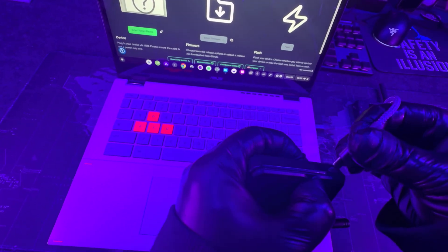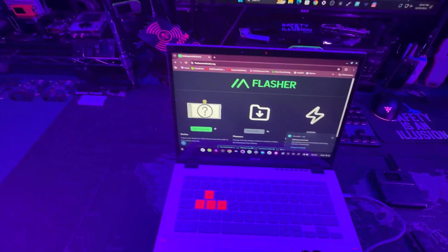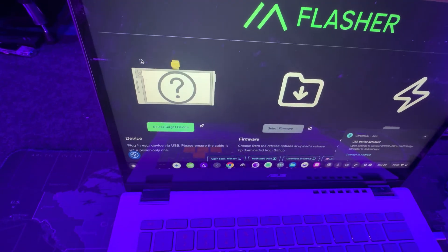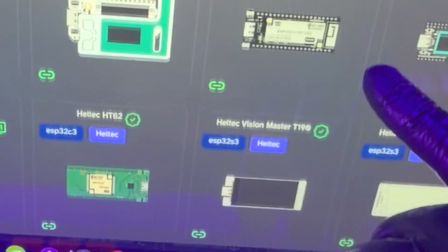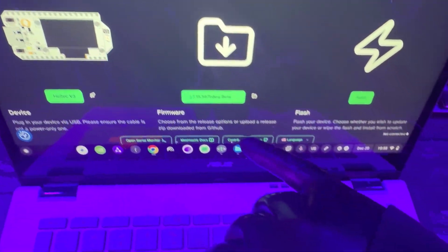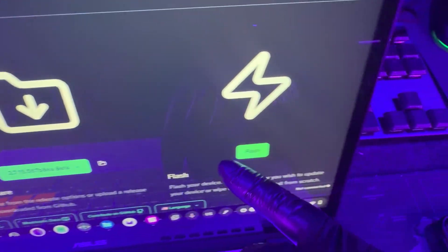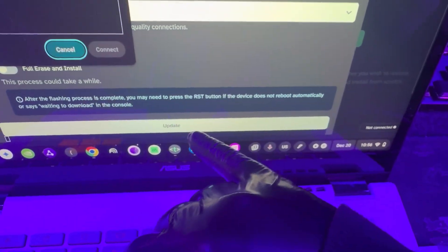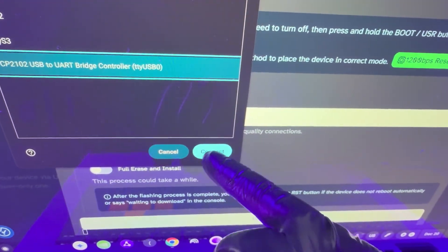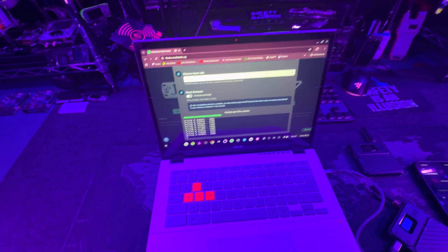You need to plug in your device to get it ready to receive firmware. Back in the day, you used to have to hold down the boot button on the device and then plug it in to get it into bootloader mode. But with the new Heltec V3s, you don't need to do that anymore — it just gets into bootloader mode as soon as you plug it into the computer. Now you need to find your device on the website. Here is the Heltec V3 — click on the most stable updated firmware, then click flash, scroll to the bottom, click continue, scroll down to hit update, and then click on your device that's plugged in. As soon as you connect it, it should start flashing the firmware.